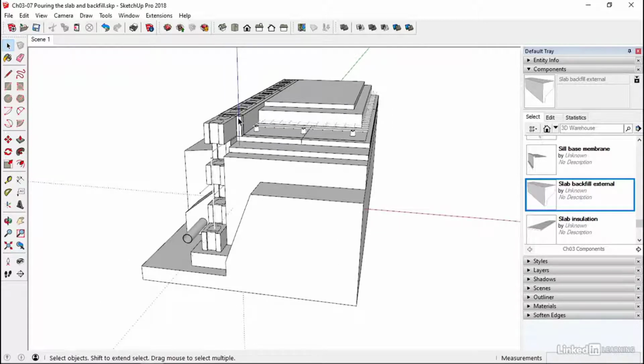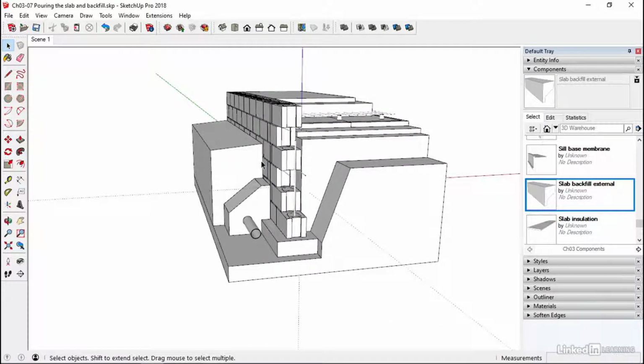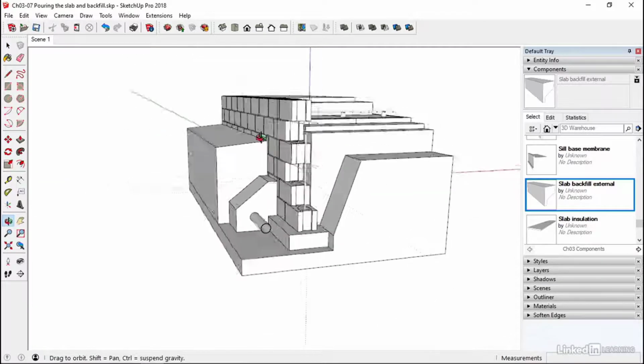We've got perimeter insulation along here, membranes over the top and coming down the wall behind all this stuff, steps over there. So we've got our perimeter drain, which is like a French drain, so water can come in there and then disperse at low level. And we've got this sort of compacted grade on the outside, which is tapered back to a fall. So that's pretty much it.